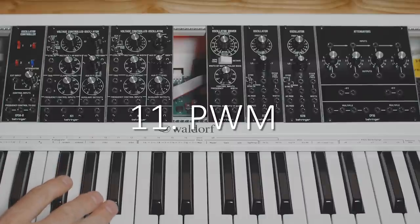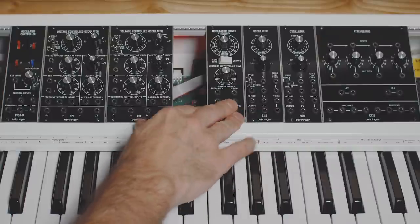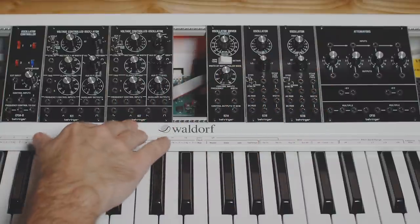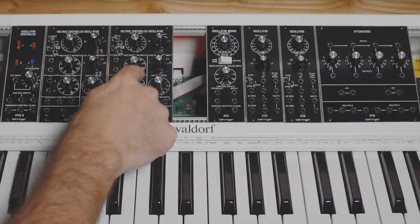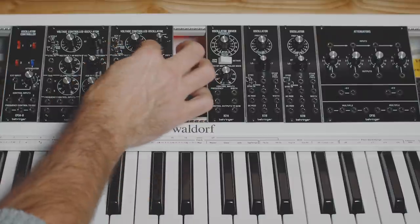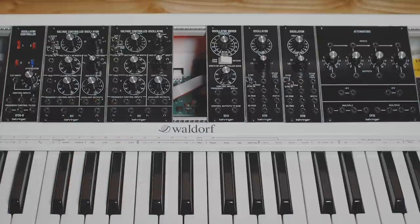Right, so one thing that I alluded to early on with this 921A and B setup here is you can use it regarding pulse width modulation. So let's just talk about pulse width modulation across all the oscillators. Let's take a 921 first of all, the standalone oscillator. This section here is called rectangular width, the width of your square wave. You've got a manual control for setting the width, and you've also got two CV inputs. So very, very standard stuff with the 921.